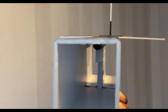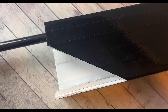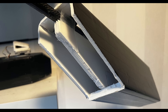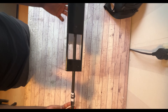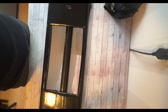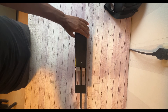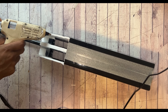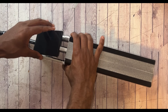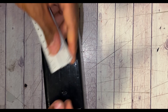You want to make sure the boom doesn't go crooked or sideways while you glue it in place. The taper I applied is 10 centimeters in length and three-quarters in height, later covered with another piece of foam board. The tail is extremely stiff but moved slightly left and right at the front, which was fixed with more plastic cards. This method of gluing a carbon tail boom to a fuselage structure came to me along the way, and I'm very happy with how it turned out — it's extremely solid and I'm confident it won't move even after years of use and landings.